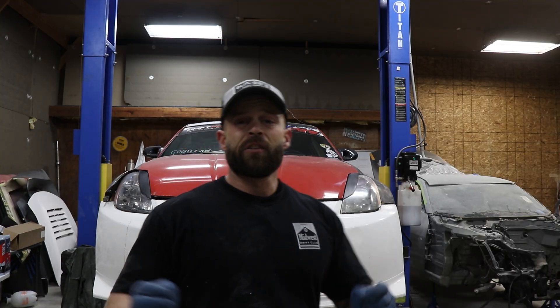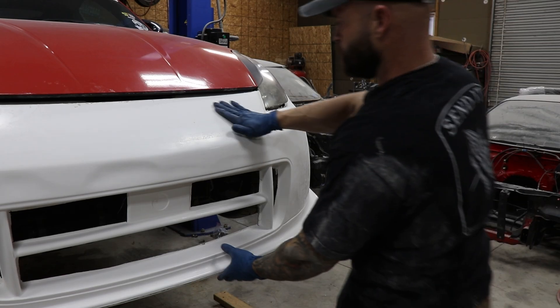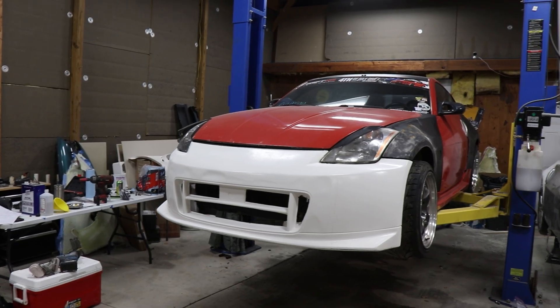I may be able to use a heat gun to try to get these warps out, but I think this is just going to be how it is, unfortunately. Even though the gel coat was thick enough to prevent alligatoring, it reduced a ton of the flexibility I really wanted from this part. So for the next layup, I'm going to do fiberglass cloth with minimal amounts of chop strand mat, then pull the part out of the mold and gel coat it after the fact. It won't have the perfect texture, but it will have the flexibility I want. While this part is not perfect, it will be fine for my car — I'm surely going to break it and I'll need to make another. Please follow along for the next video where I'll try this layup with fiberglass cloth and chop strand mat without gel coat and then doing that after the fact. I haven't seen anyone do that before, so maybe it'll work.